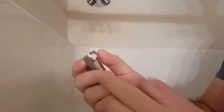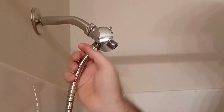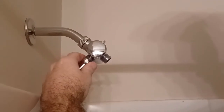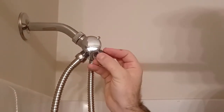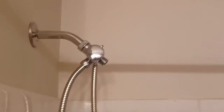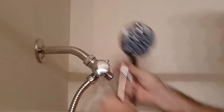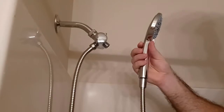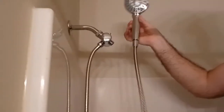Now don't let the look of this fool you — you're never supposed to use a wrench on these. A lot of people mistakenly use a wrench and they strip them out or over-tighten them. This valve here is just plastic, so you can easily over-tighten it. If you get it as tight as you can by hand and it's still dripping, you can take a tool and just slightly turn it maybe an eighth of a turn. So we'll go ahead and slip that up there, and I'll grab the nozzle and install the shower head itself. Make sure you put your rubber washers in there.